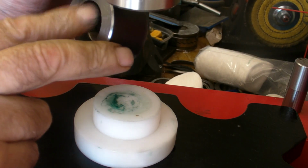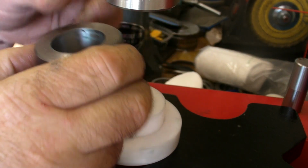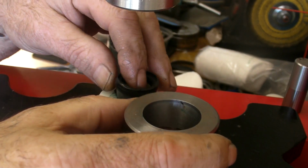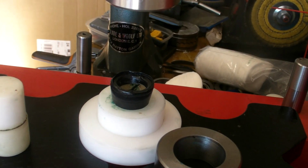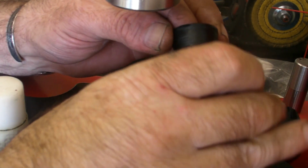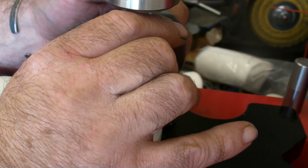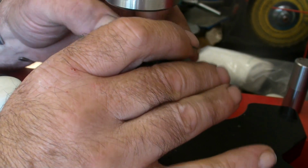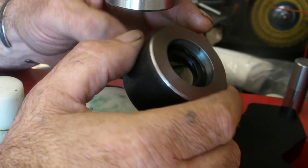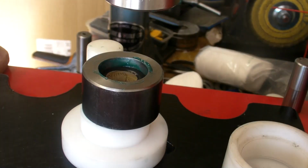Right, now, you see what I'm saying about the volume of pressure on the bottom of these when you push through a port there? Now, if you take your reducer ring like that, and it comes out. See, it's out of there, so you've got a little bit of clearance. So you're reducing the volume of pressure. Well, then we'll push through completely on that, and we'll see what shape it is. But I am going to anneal that because I'm pushing through on that.